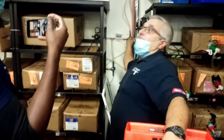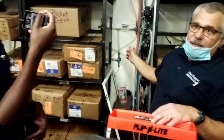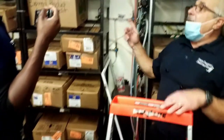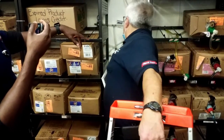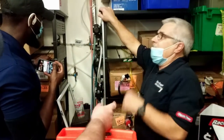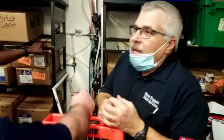But if you've got no CO2 anywhere, check to make sure that's not turned to backup, where it's not hooked to anything. I've had it happen. Emergency call in the middle of the night, and it's turned to backup. You turn it back up, and everything comes on. So if it's on backup, there's nothing connected. You've got no CO2, nothing, because that CO2 line comes up and goes right into it. So once you shut that off, that's like turning this off.